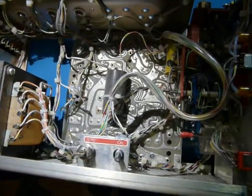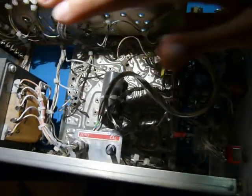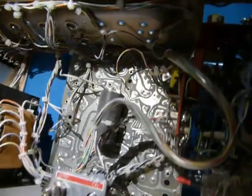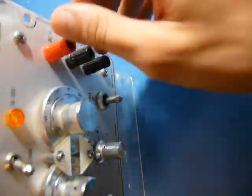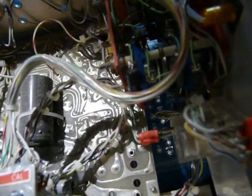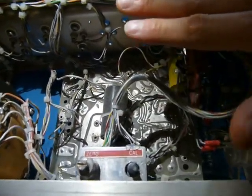For a quick overview: this thing was manufactured no earlier than 1987 — that is the most recent date code I found on it. But basically it is a glorified 7805, or LM317. You've got your transformer here providing an unregulated source, a bunch of pass transistors that connect your unregulated source, after some filtering, to the output. And then you've got some control circuitry to control the base current of the transistors to provide the appropriate voltage.